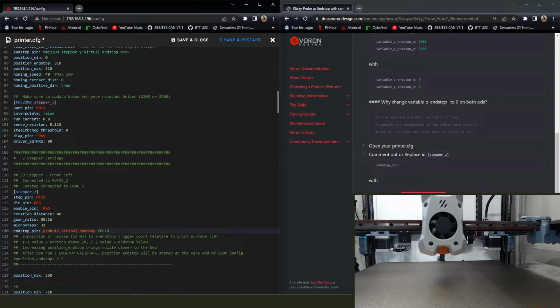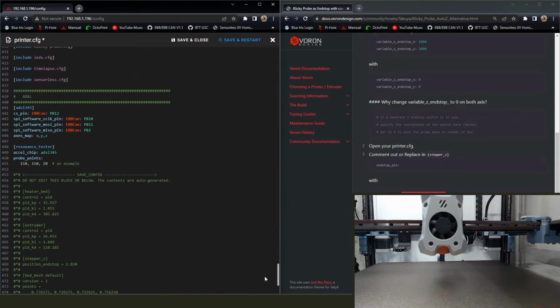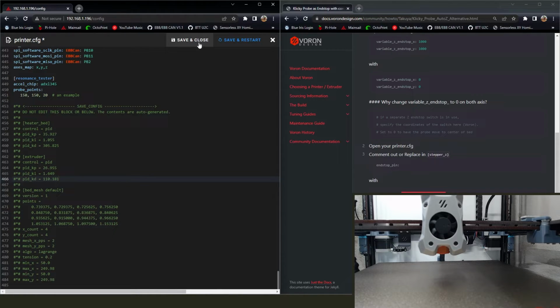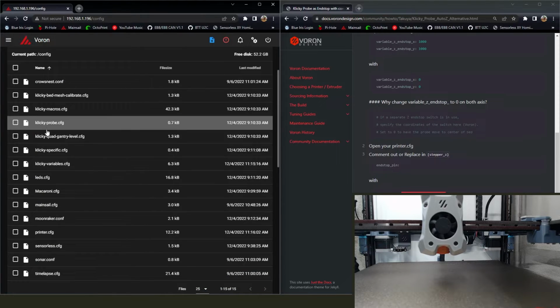I'm also getting rid of the Auto Z because I don't change build plates, I don't change nozzles, as much of a novel, cool idea as it is. And don't get me wrong, it worked fantastic. It was extremely good at what it was. I'm just going to go back to setting an old school, consistent Z offset, and I can dial it in once a month or however often I need. I don't change things that often. So anyways, hopefully you were paying attention there.